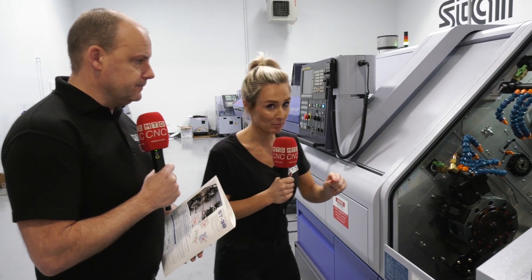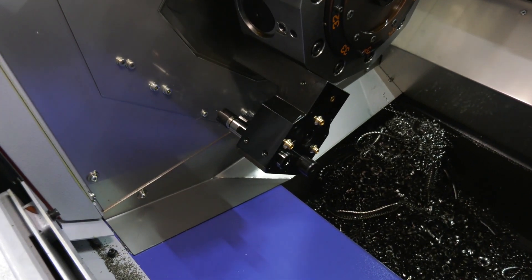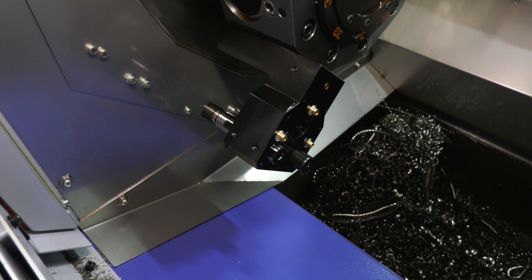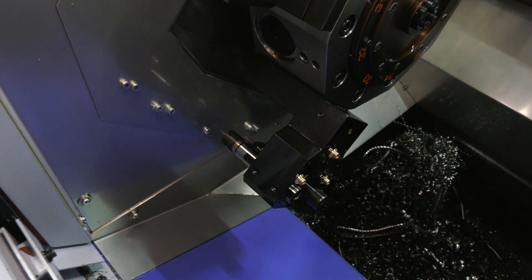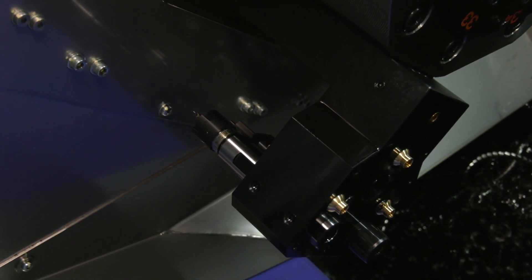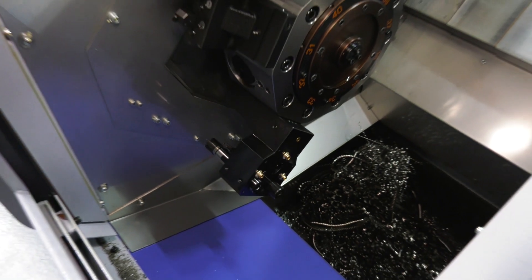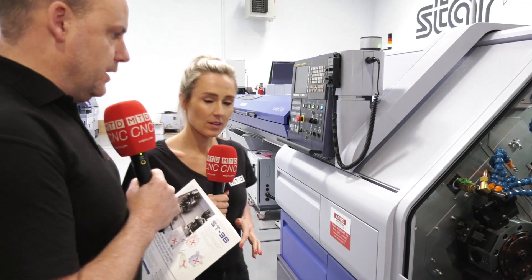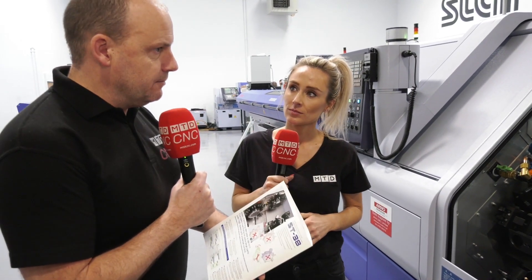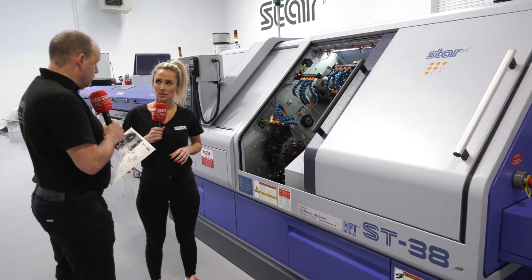Now this is going to be quite tricky for the cameraman, but there are two tools here on one station. What about the clearance of those two tools? Well, it's a good point — you would work with somebody like Star to look at the application you're doing, and they would specify the right tool for the job. At that point they'd look at the clearance between the tools and whereabouts you're going to use them in the operation of the part. With their control software there's a lot you can do offline these days to ensure there aren't going to be accidents, because when a machine like this is going, there are tools, swarf, and coolant flying everywhere.